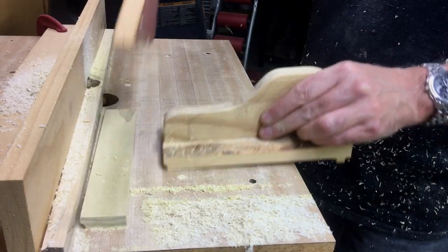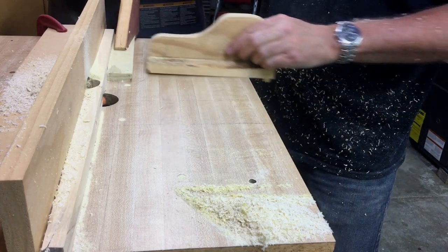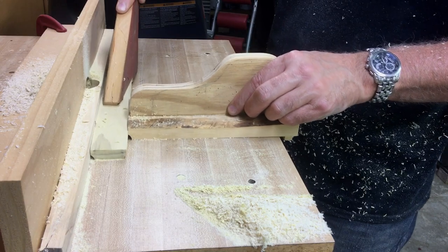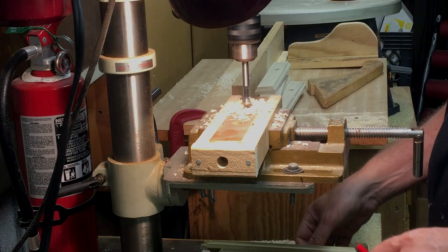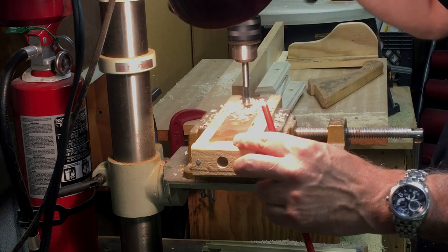The process begins by cutting blanks from a 1/2-inch thick sheet of poplar. They are then edge routed for a more finished profile and then sanded. With the use of a jig, registration holes are drilled for the clear acrylic pedestals that the full hull version sits on.